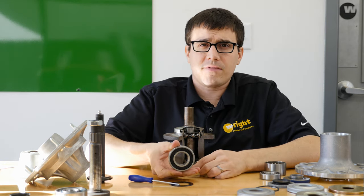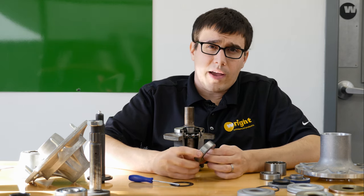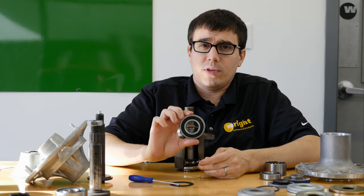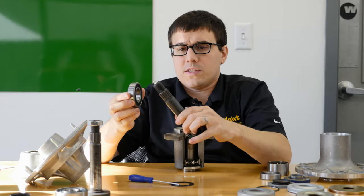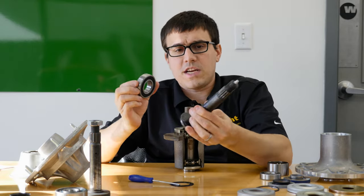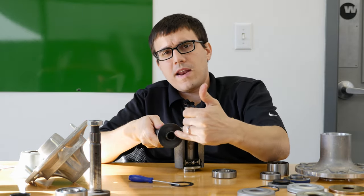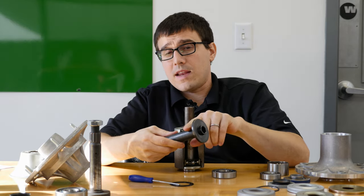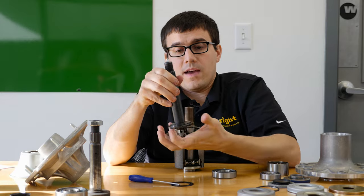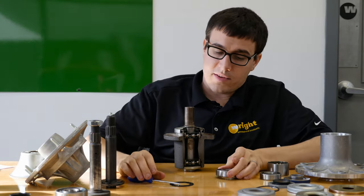We also get to put a really big shaft in there. In terms of things like keyways and bending the shafts, it's really not an issue with a big bearing like this versus a smaller shaft. Just notice the threading here versus the size of this wall — this wall is pretty thin, and so if you have impact, the shaft is most likely to bend there. When you have a big sturdy shaft, it helps a lot. So those are some of the different bearing options that are out there.